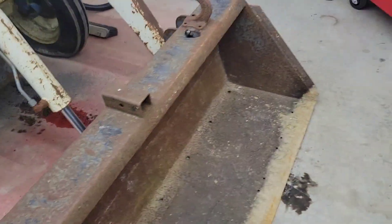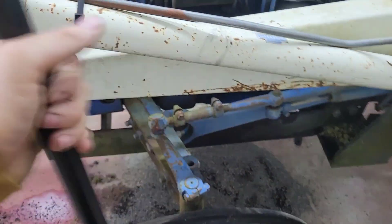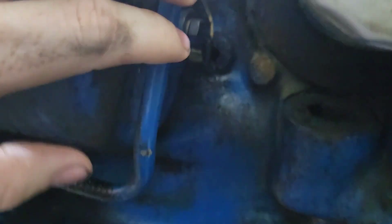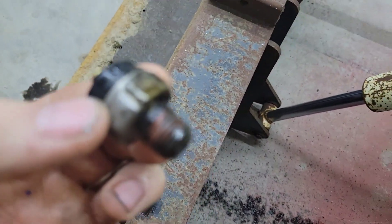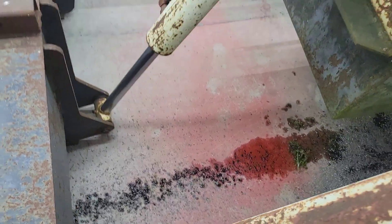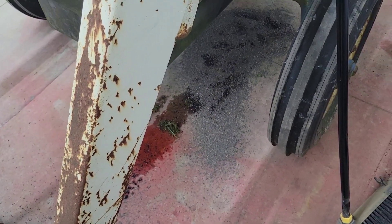Another thing going on with this tractor is the reason I wasn't able to run it a whole lot. As you can see, all the oil — this oil pressure switch goes right there. It is a threaded switch that goes right inside the block and this clip slides on the end of it. The old switch, as you can see, still has oil coming out of it. I don't know if it's because the threads were damaged or not, but it failed. That oil was gushing out the side, so I had to get it parked and stopped as quickly as I could. That is why the previous owner stopped using it to begin with and left it out in his yard for a year.